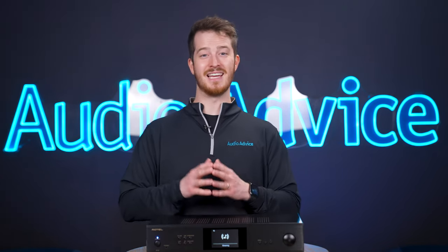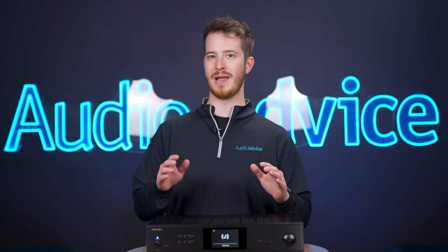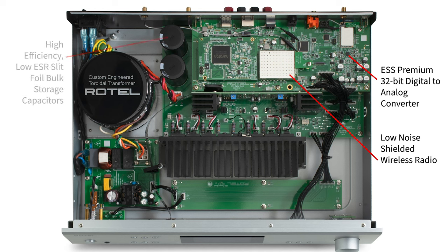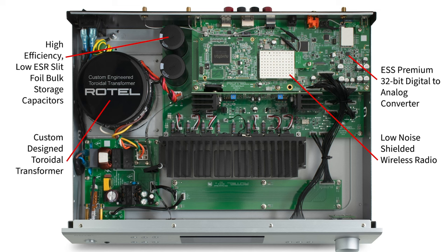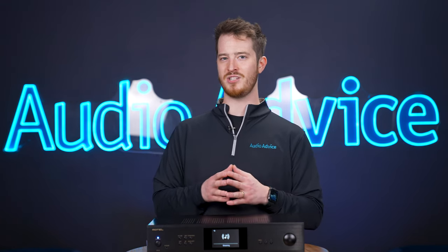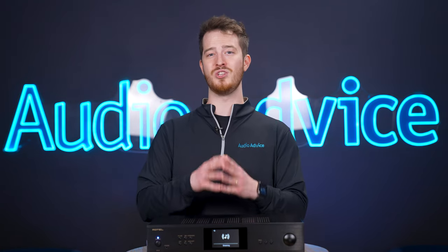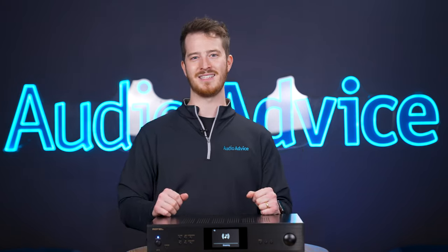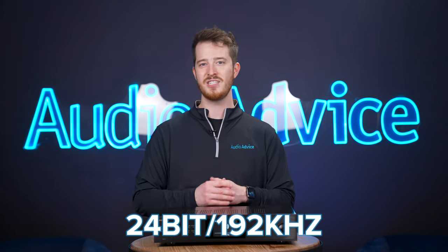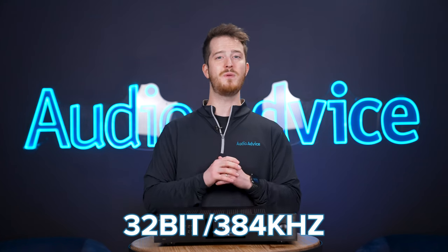The technology behind the S14 is a combination of leading-edge streaming technology and tried-and-true amplifier technology. Rotel designed and built all of the S14 themselves, only sourcing the streaming system from an outside partner, but they were meticulous in finding streaming components worthy of the S14's reliability. The DAC inside is an ESS Sabre 32-bit chip. This DAC can handle 24-bit 192 kHz from a USB Type-A flash drive, coaxial, and Toslink connections, while the Type-B USB computer input can handle 32-bit 384 kHz.